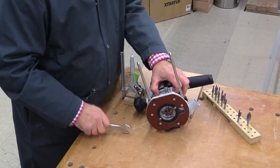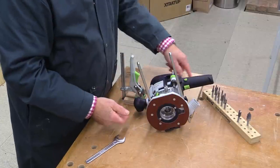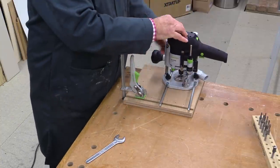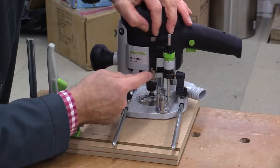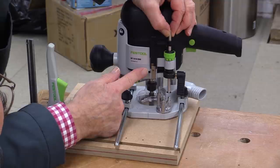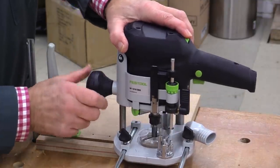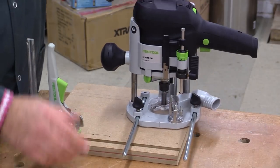I'm using a 10mm cutter and it's one of the professional ones — I can easily do the whole 8mm depth of cut in one go with this cutter. To set the depth, with the router sitting on the surface of the material, plunge down until it stops, and lock that off at that point. Then release here, send that down — this is zeroed — and I'm going to lift this up so that I can see 8mm in the window. With that at the 8mm point I can lock that off. When I do a plunge, that's going to go down to that stop and my 8mm cut is done.